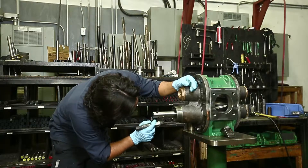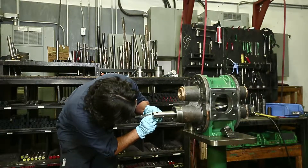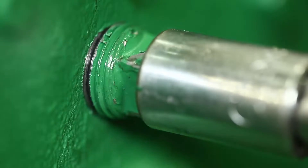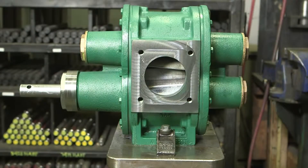Make sure to put on all safety wear prior to moving the pump into position and prior to commencing any work on the pump. Do not attempt to move the UltraSeal pump without the assistance of another person and/or proper lift equipment. Before beginning work on any portion of the pump, ensure that the pump is drained by removing the 3/8-inch drain plug from the end plate. UltraSeal pumps may be used to pump hazardous substances — ensure that you flush an UltraSeal pump that has recently been used to pump hazardous substances, and only work on it in a well-ventilated, secure, and safe place.